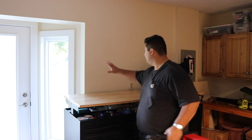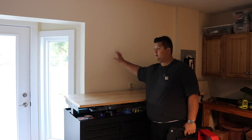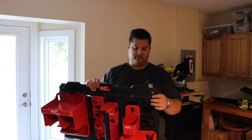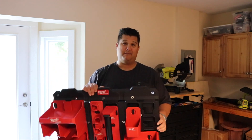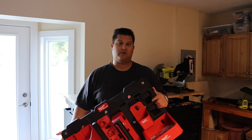I bought a 1x4x12 piece of wood. Behind me I've got a 60-inch space, and my plan is to have a piece of strapping here and a piece of strapping there. Milwaukee basically wants you to use no less than four screws per board, and I think I'll be able to use at least that many on the top and at least that many on the bottom. So let's find some studs and go from there.